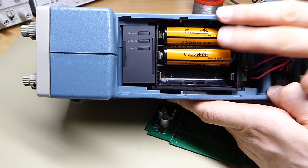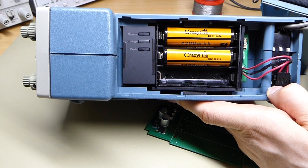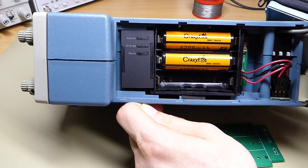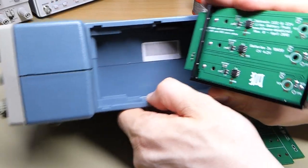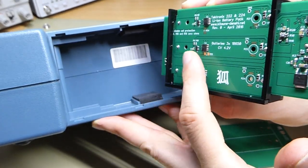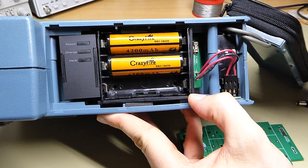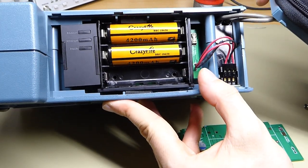Even if you have normal batteries in there that don't have completely unreliable numbers on them, you will probably get a bit more capacity than you did with the original lead acid battery. One slight niggle is that I'm having a fairly low charge current on the batteries, which has to do with the scope having its own built-in charge circuit that doesn't play very nicely with my circuit. Apart from that, I also added a battery protection circuit that means you don't even have to use protected cells — it will detect over-discharge, over-voltage, under-voltage, and cut the cells out if necessary. So in terms of future-proofing, you can stick in any lithium-ion battery as long as the charge voltage is 4.2 volts and it will just work.